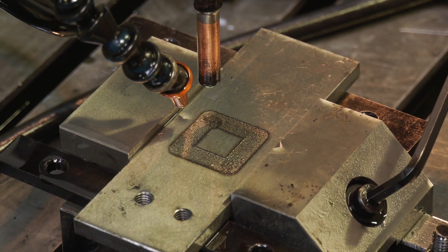And would the control help guide you on how fast to cut in order to get the best finish? Is that part of the software as well? It can be, yeah, because you can run a multi-stage program in there, where you're going down set depths with different parameters on your machine. So you start off at higher power and then work your way down as you're going for a finish.